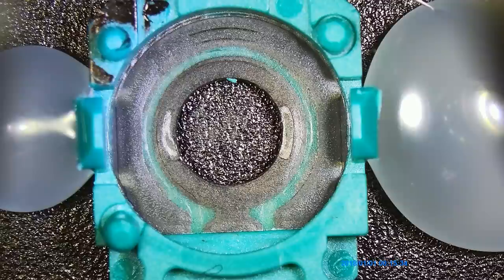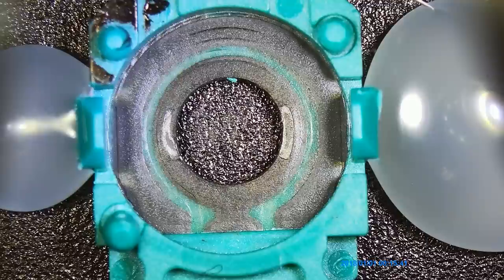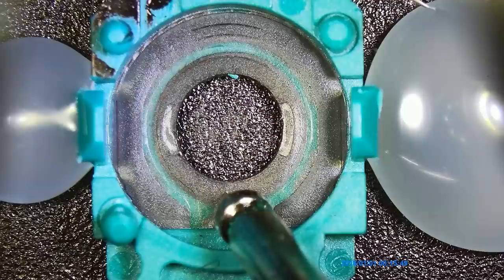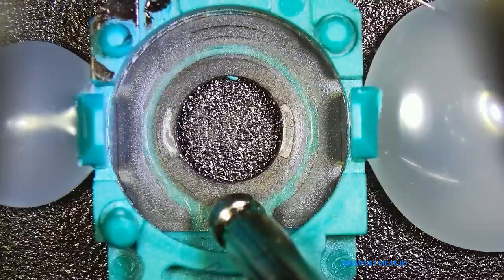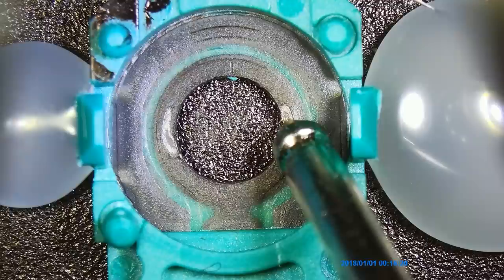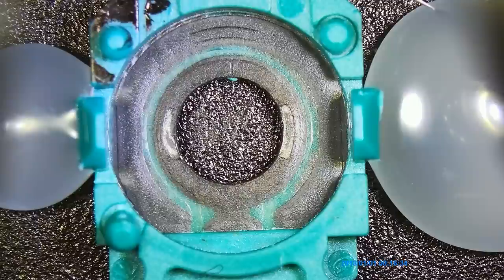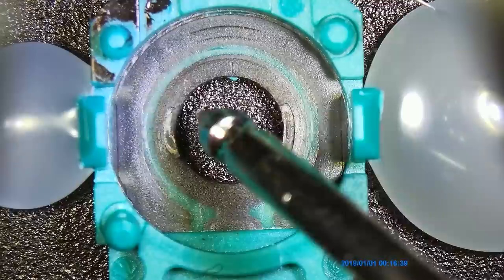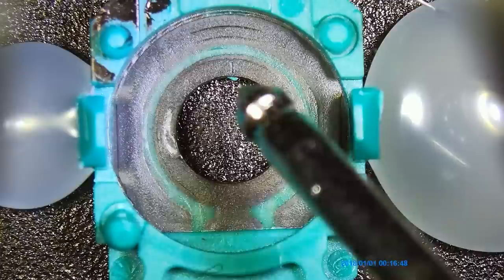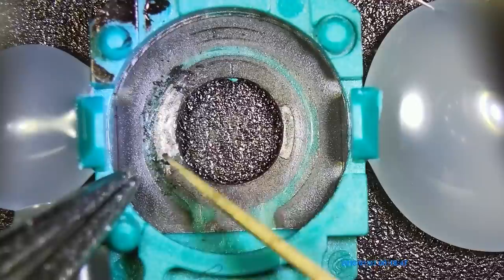I've got one of the leads on this side. There's actually a fair amount of resistance just from the carbon to the lead — about 120 ohms. The other side is 160 ohms. Is the carbon worn away? No connection! There's metal under the carbon — unless they're carbonizing the plastic. Measuring 121 ohms resistance on one. Do we even need to swap the axes? I think we can call this — it's the carbon film potentiometer.